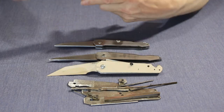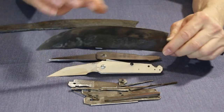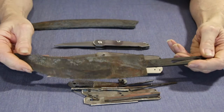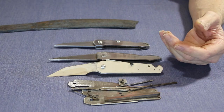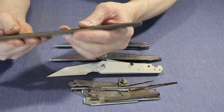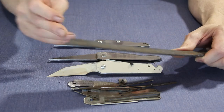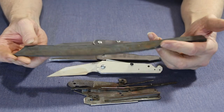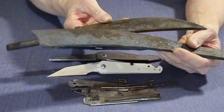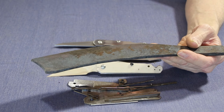I'm going to finish this off — it looks all right but it's actually a disaster. It's cracked because like an idiot I heat treated it in water instead of at least canola oil. So I'm going to make a full tang on this, change this bit, forge it back down, cut it back, and it'll probably become some kind of chopper. Both of these blades were bits of farming machinery — spring steel — though I'm not quite sure what bits of machinery they came from.